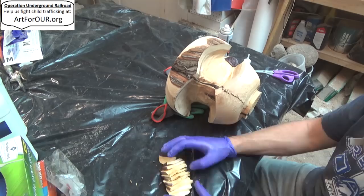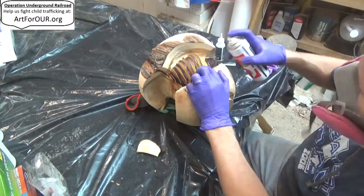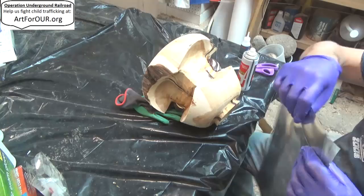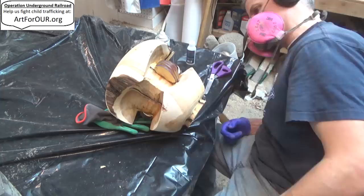This Starbond glue is just fantastic. It comes with an accelerant if you buy it. So you squirt the glue on there, squirt the accelerant on there before or after, it doesn't really matter, and it'll harden within seconds, which makes it possible to mount many items really quickly. I'm always wearing a respirator because it stinks, and I don't think it's good to inhale that stuff.